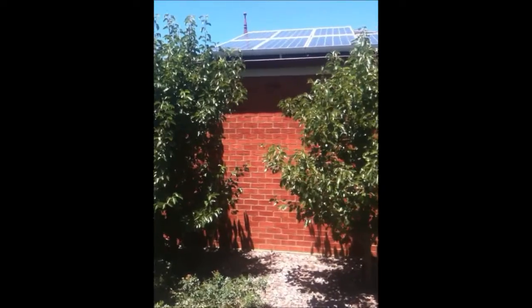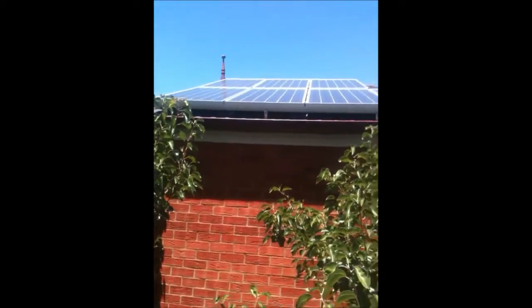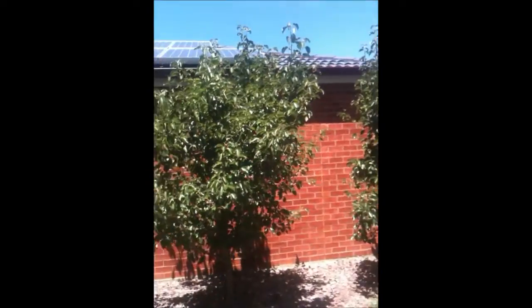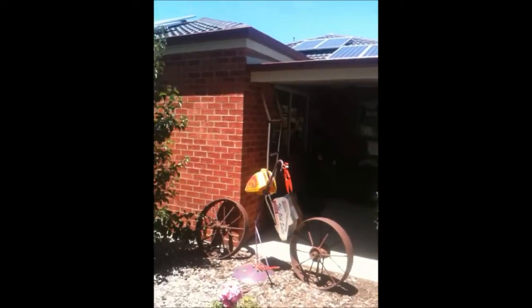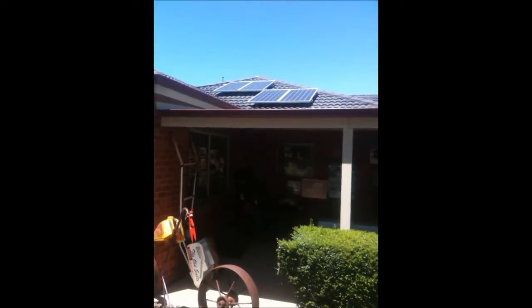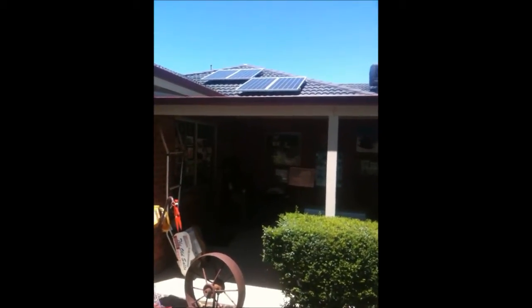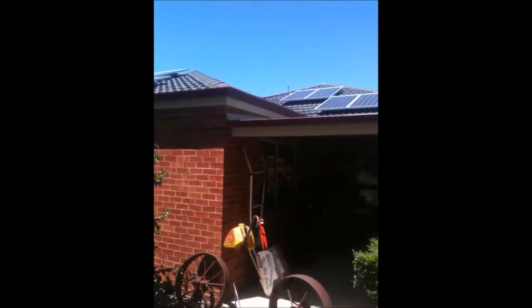The tile hooks are stainless steel — you can just see one up under that ridge over there. They are stainless steel and quite unique as well. We don't actually have to drill through the tiles to fix them into the rafters. They go up and under and around the tile. We grind the top tile flat just to make them sit a little bit more flush, and as you can see they are up there quite strong, mounted to those tiles.